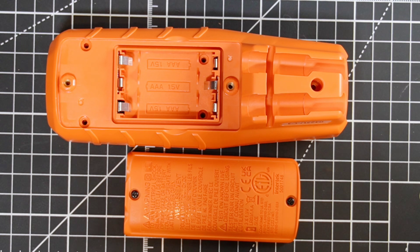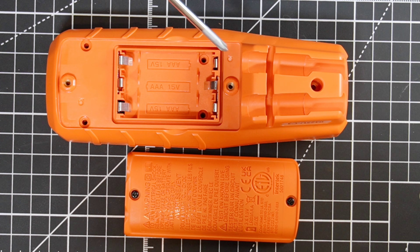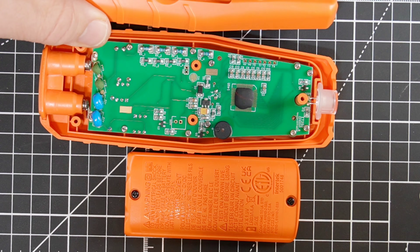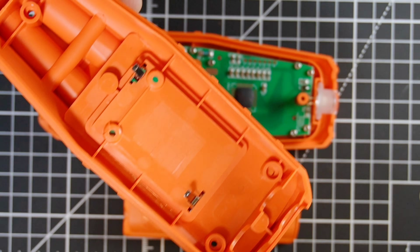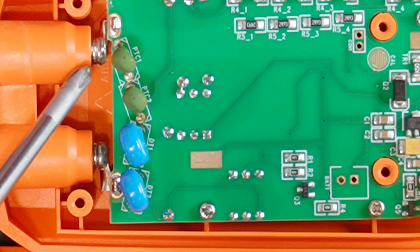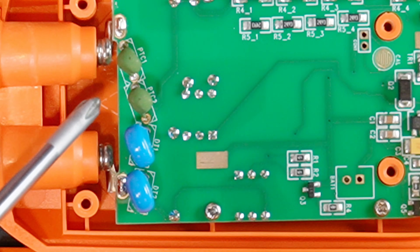Teardown time. Inside the ET250, it has that Cat 4 600 volt rating, which basically means the tester and its test leads are designed to safely handle measurements on low voltage mains circuits. Safety is paramount with Klein — always has been. Double insulated, class two construction. Internal electronics are designed with reinforced insulation to protect you from internal shock. Pollution degree two rating indicates the environment for safe operation, both indoor and outdoor. The safety rated test leads are also Cat 4 600 volts. Look at the input protection — two MOVs, two PTCs, no shunt resistor of course because this does not do current, but some gorgeous looking input protection there.